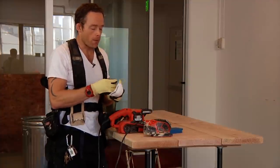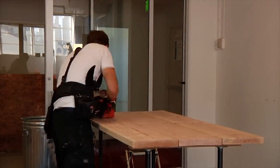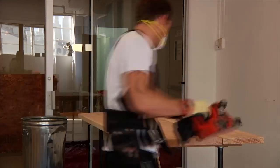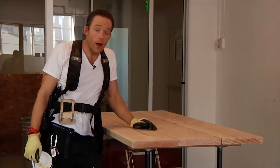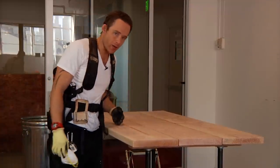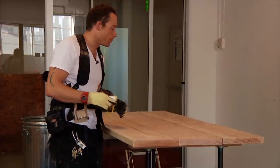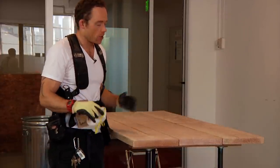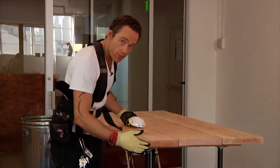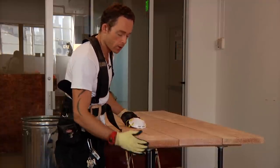When sanding something like this, you don't have to be Michelangelo. Just make sure you're always sanding in the direction of the grain; otherwise you're going to get big marks throughout your wood. Just take it slow. Watch your edges — if you want to round them off, you can hit it with the belt sander, palm sander, or by hand.